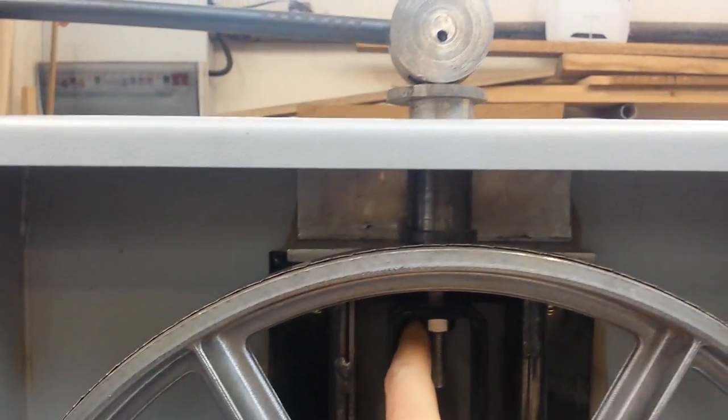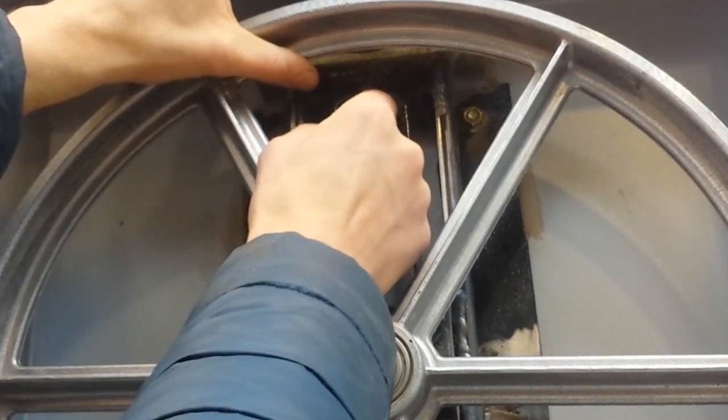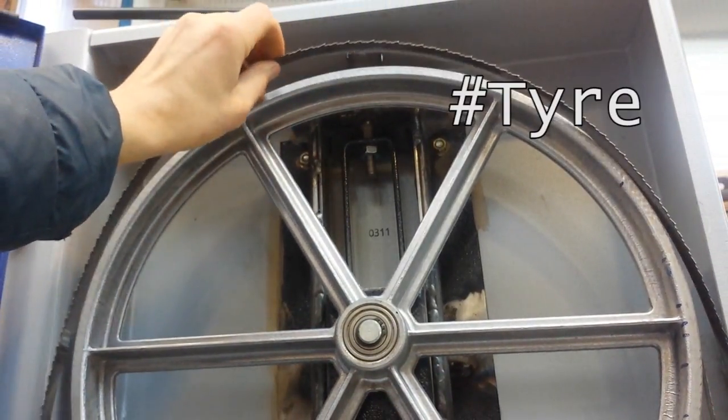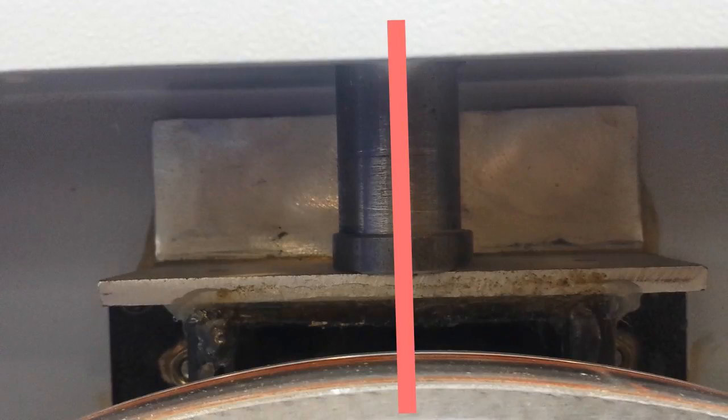With the cam loosened, this nut is just hand tight and can be unscrewed, enabling the blade to be completely removed. Most of the time if I'm just leaving the bandsaw for a few days I'll just loosen the cam, and that's enough to alleviate any worries about wheel deformation. The rod goes up through that pipe — it started life as an 8mm threaded rod which was woefully inadequate, and has been changed to a 10mm one. It essentially pulls up on the wheel mount, tensioning the blade.